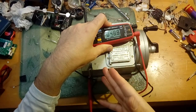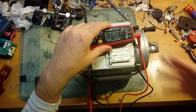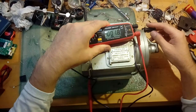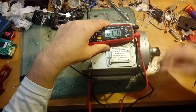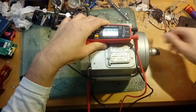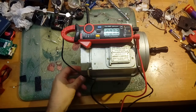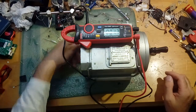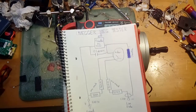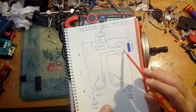On the AC range it shuts off the meter for some bizarre reason - now that I've added the capacitor in circuit it can't handle the AC, probably because it's super noisy and only the Fluke can cope. On the DC range we're up to 476 volts - and yes, that is no joke. It's slightly under 500 when you've got all the resistors loading it down. Quintessentially, that's how it works, and there's definitely more in this circuit related to how the meter itself is calibrated.